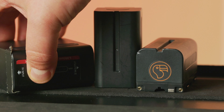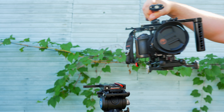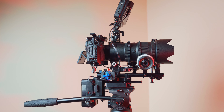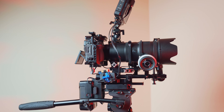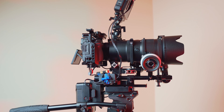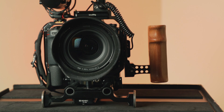If you're ever going to need dual powering options — powering a monitor or other accessories — I think the SmallRig is probably the best option. The most important thing to know with these kinds of cheap battery supplements is you don't want to fry your camera. I have fried my camera before using a USB power solution and a V-mount battery. The advice I now follow: always make sure to plug in the power cable first, then connect the HDMI cable, and power off the camera and monitor before plugging them in.